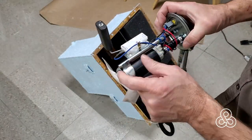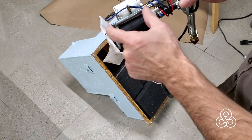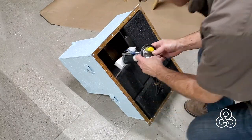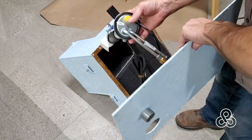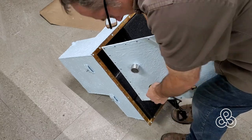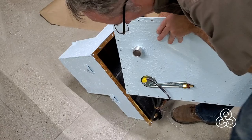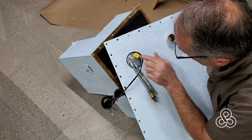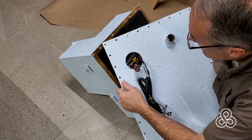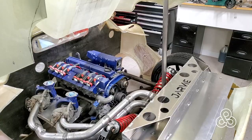I'm not going to install the foam permanently right now until I get the fuel sender finished. Here's the fuel sender — just a small lightweight pump, not the final pump to build pressure, but just to move fuel out of the tank. I need to extend the length of it a little bit to reach the bottom of the tank, but we'll also have a fuel sender in there to give us our fuel level. It uses a tab that will run across the top, tighten up, and pull an O-ring against the bottom to seal it against the inside of the tank.